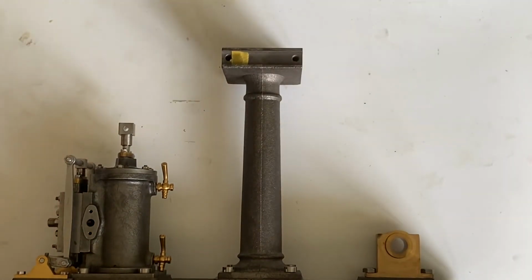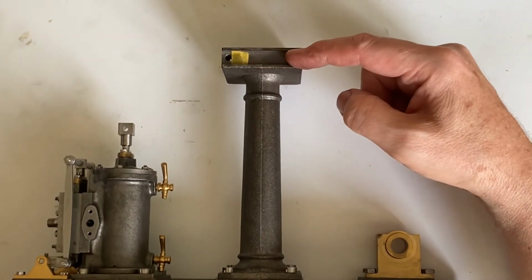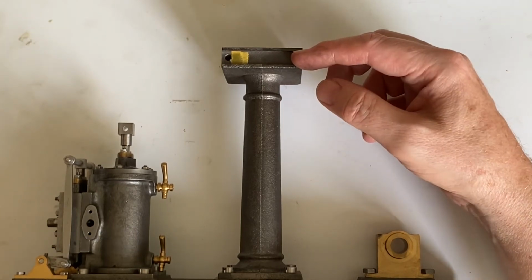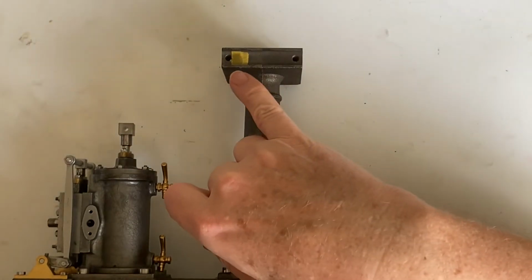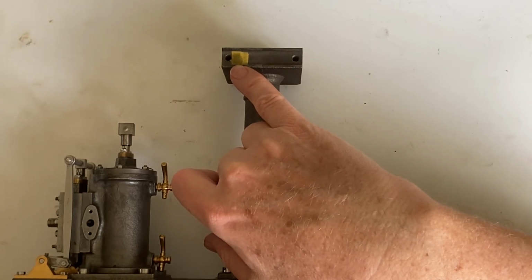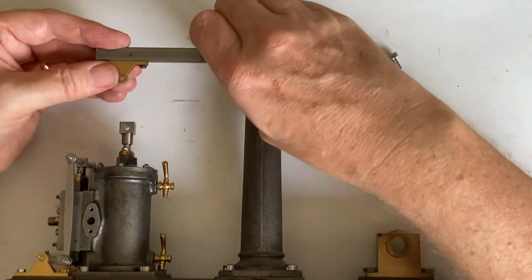Now, when I was doing a trial assembly, I discovered that the 2 faces of the top of the beam hadn't been machined quite parallel. They were only a smidgen off, but it was just enough to pull the 2 ends of the entablature in slightly too much. This has been fixed by a couple of layers of masking tape which just space out the entablature to bring it parallel. It was only a tiny smidgen out. The entablature is fitted with 2BA bolts.